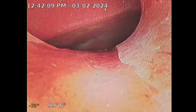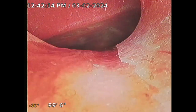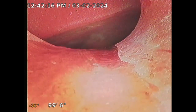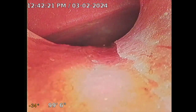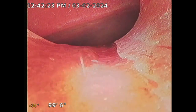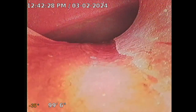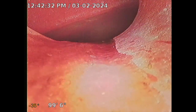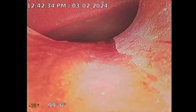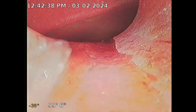I'm all done with the sewer line inspection. This is the city saddle and it appears serviceable — I don't see any issues with it. A small little cracking section, but it's flowing properly. I just flushed the toilet — my compadre inside flushed the toilet. We should see a gush of water in a second. That would be the flushed toilet. All in all, the sewer line looks good — there's that flushed toilet. It looks good.